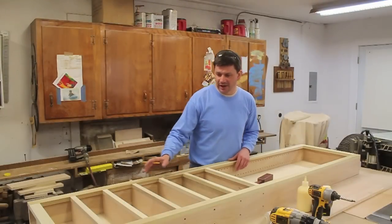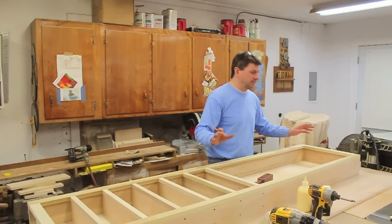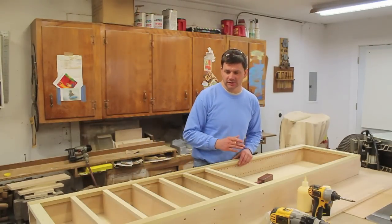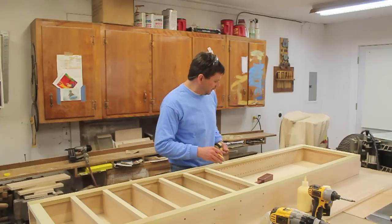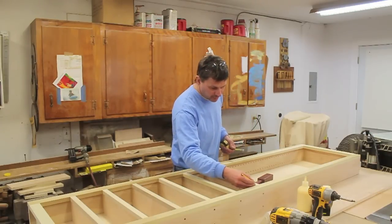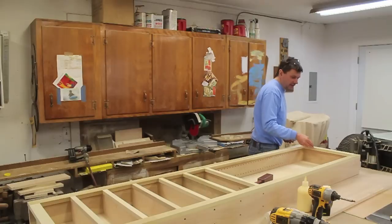For the most part the cabinet is finished — I still need to sand it and fill the holes with wooden plugs, but I'm going to do that after I make the doors, give it a final fitting, and then the whole cabinet gets sanded and I start the clear-coating process. I just need to figure out the doors. I'm going to have a half-inch reveal on the inside of the face frame on each side, and a quarter-inch reveal at the top and bottom.